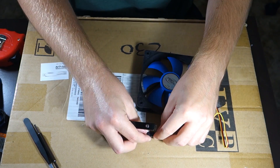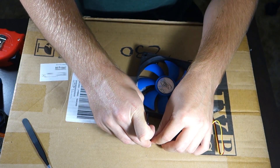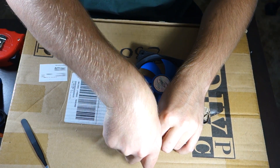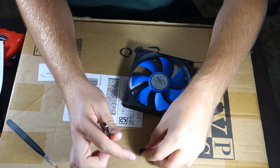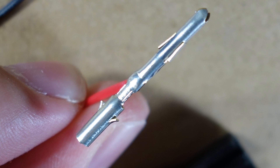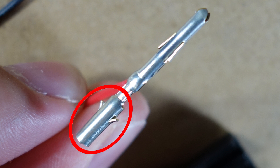To remove these wires, you're going to want to push down on the pin while pushing in on the wire so that the pin doesn't rest on the plastic and goes down. If you're lucky, the first tool I used will work and all of them will come out at once. However, you may end up having to do them all individually, which is what I did here. It may require a little bit of force, but you don't want to use too much as to smash down the connectors or pull the wire right out. Now moving on to the Molex connector — on your screen is an individual wire with its connector; the top right part is the end that we use our tool on to get it out of the Molex piece. You can see both ends have pins, but you shouldn't have to manipulate the bottom left end at all.